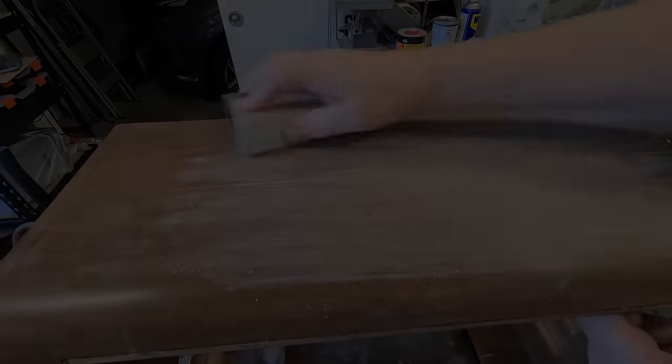The cabinet's ready for its top coat. I've put new stain on it and I've done around the edges in the black again. This time when I put the stain on I actually sat there and rubbed it right in - the first time I sort of slopped it on and rubbed it off. I think it's come out much better the second time around. This is the clear coat I'm going to use - it's a Dulux Duramax. I've used Duramax paint before and it's pretty good. I don't want to destroy my new camera so I'll just spray this little bottom bit here to see how it goes on, then take the camera outside, finish spraying it, and come back when it's finished for an inspection.